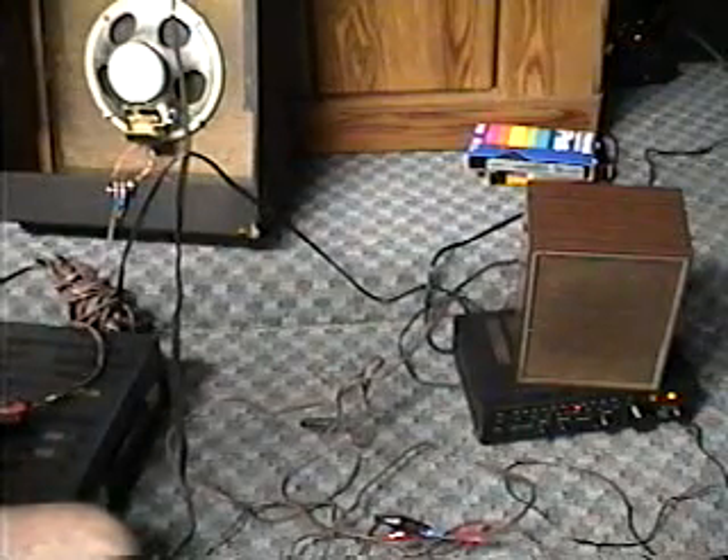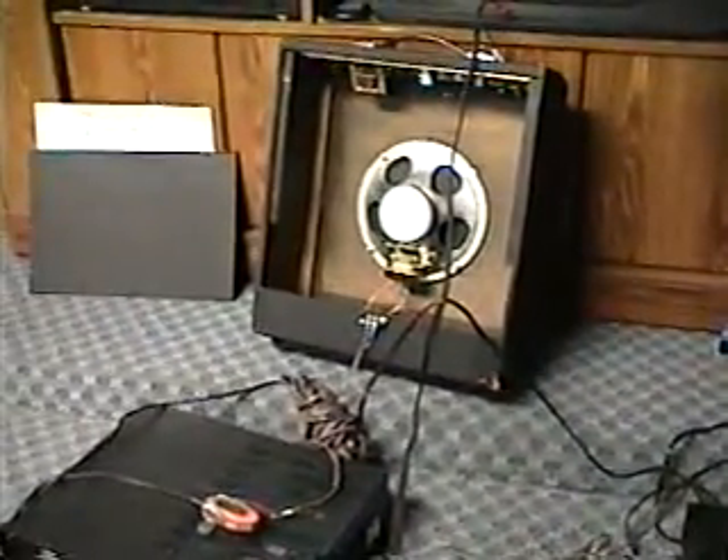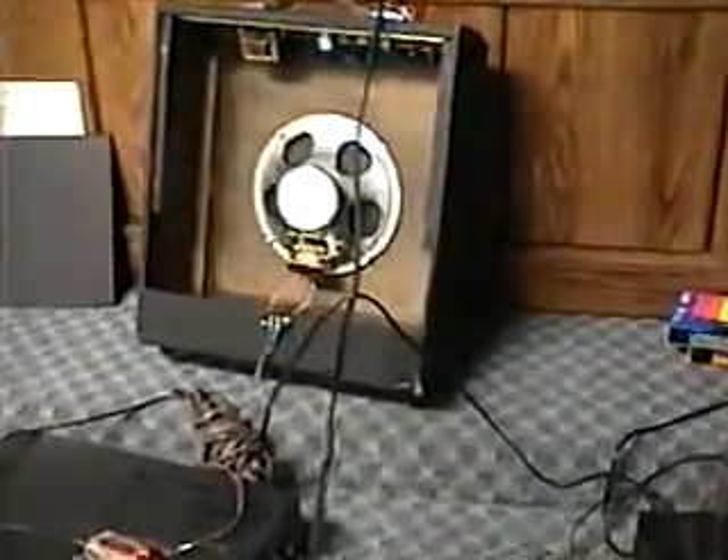What I have set up here is a 30-watt stereo system and also a 100-watt PA amplifier. When I use the 30-watt stereo connected to the PA speaker directly — bypassing the transformer — the sound is loud. But when I go through the transformer, the sound is soft, and it doesn't matter what tap I use, the sound is still soft. I'm going to give you a close-up of the speaker with the transformer.